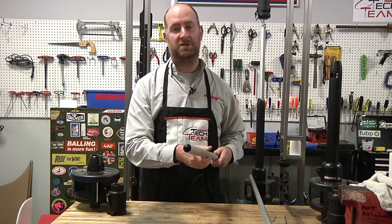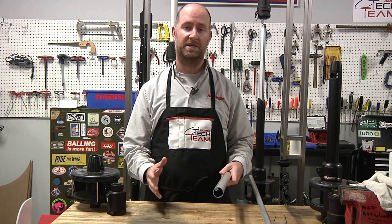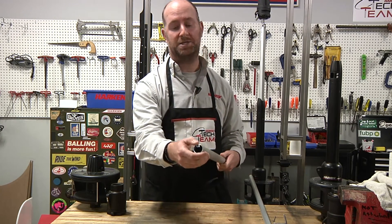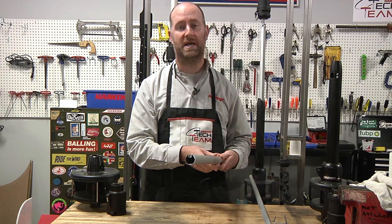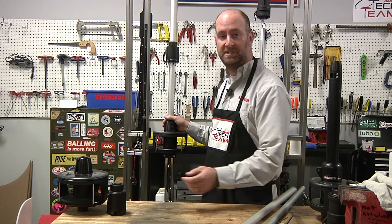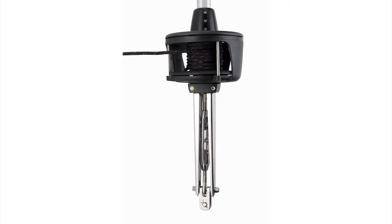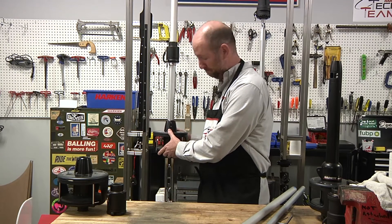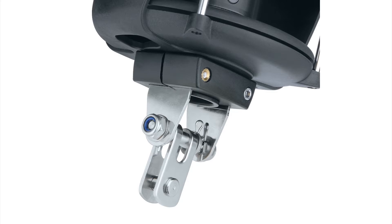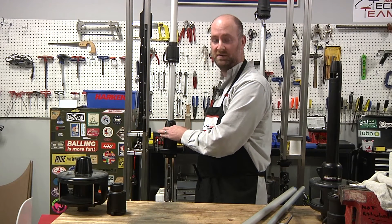The ESP is a simpler product due to its round foil design, which provides a much smoother furl geared toward someone who will mainly be cruising. They're not going to be doing any headsail changes, which is why it offers just a single groove foil — one sail that goes up and stays up. Another benefit of the ESP is its simple design and leg kit. With the long leg kit, it fits right over an existing turnbuckle. With the short leg kit, which keeps the drum lower to the deck, a turnbuckle is not available. Instead, both ends of the headstay use a swaged-on eye with a fixed headstay length and no adjustability.